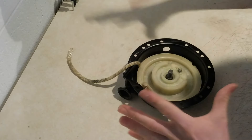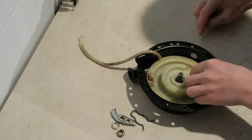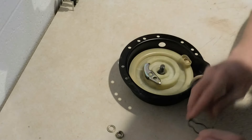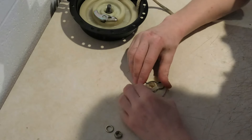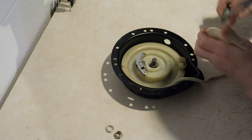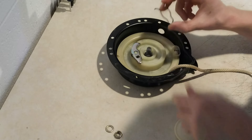Before we get too far, we don't want anything going popping and flying out, so we'll grab the rest of the pieces and put this all together. Your spring goes on first — there is a long end and a short end; the long end goes down into the plastic thing. Put your pawl on — pretty self-explanatory. It should have a little bit of pre-tension on it, so when you push it and let go it should spring back down. This piece right here you can just pull open and spread — just don't let it go flying. Spread it, put it on your friction plate; it should go all the way up against your friction plate with the little end sticking down. Now, a lot of people put their friction plate on so the spring goes like this with a tooth on each side — but that's actually wrong. It's supposed to be both teeth on this side like this, so make sure you do that when you put it on.